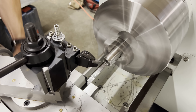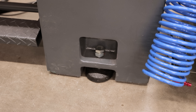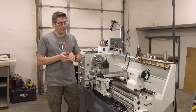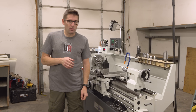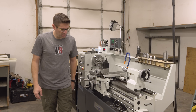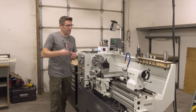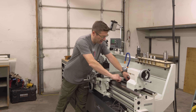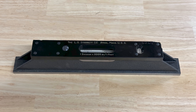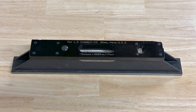When we got the machine moved in, one of the first things that I did was to get the jack screws in place and get the cast iron feet underneath. I did notice there's not a lot of flex in this cast iron base, so I would actually have one corner slightly off the ground until we got those jack screws and feet in place. What I like to do for leveling the machine is I take a couple of parallels and just put them on the ways here, and then take our machinist level. This is a Starrett — one division on here is five-tenths over a foot.